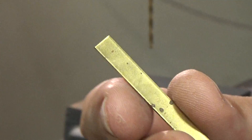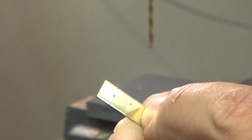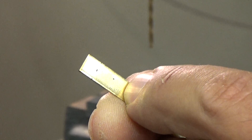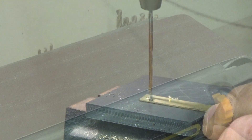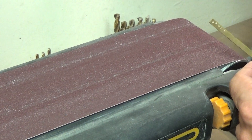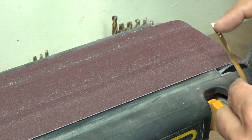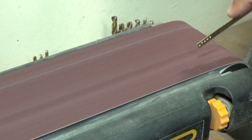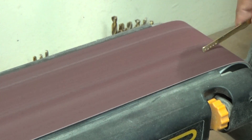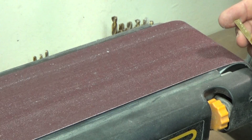What I'm going to do is drill a series of holes spaced about 3/16ths of an inch apart, putting four or five of them down the length of the brass stock right down the middle. Now that we've got that done, I'm going to round off the outside corner and grind off the lip that got created on the bottom — just a little bit smoother.